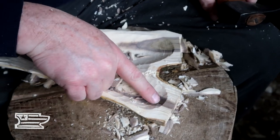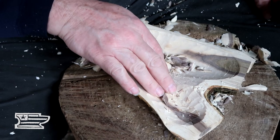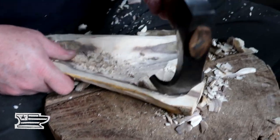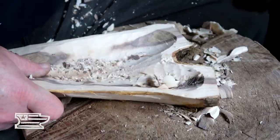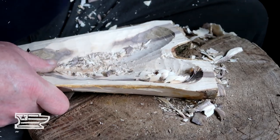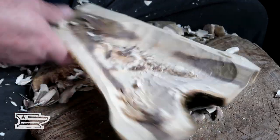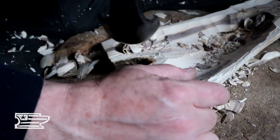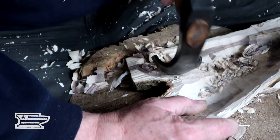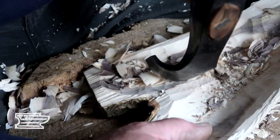I still got that core way low on this side. So I'm going to go in here as deep as I can, then we'll clean that off and get down to that core so we don't have a core stuck in there that can split on us later. I don't want to do all this work making a bowl and just leave a known flaw in there so it splits out. If a flaw you don't know about gets you, that's different — but leaving one in there to get you is just kind of tempting fate.